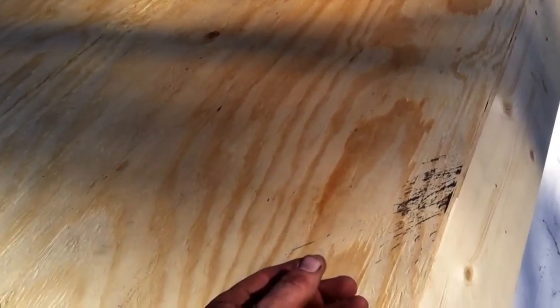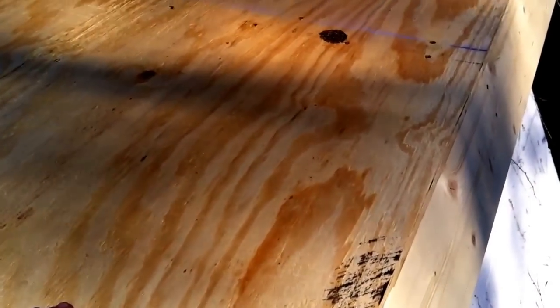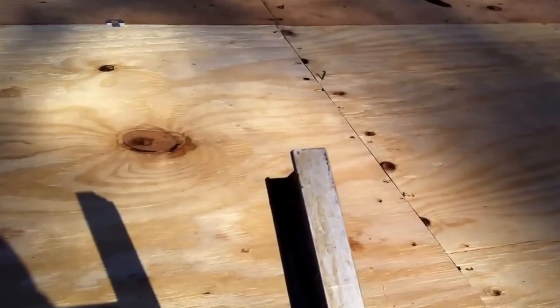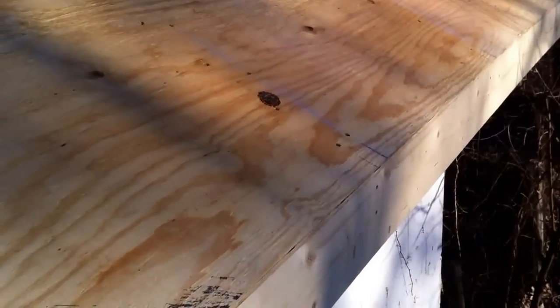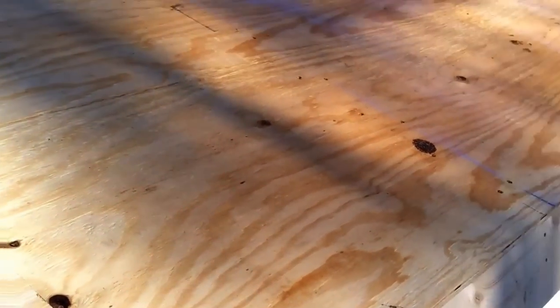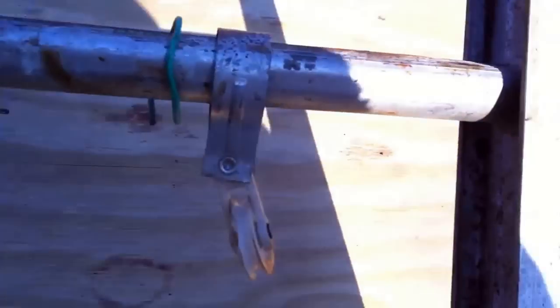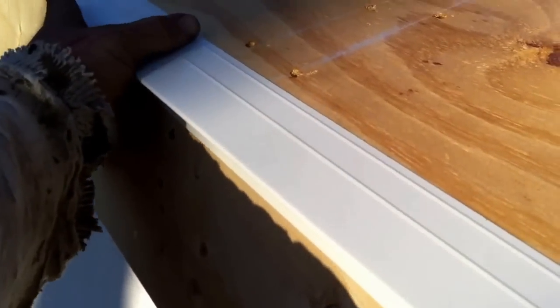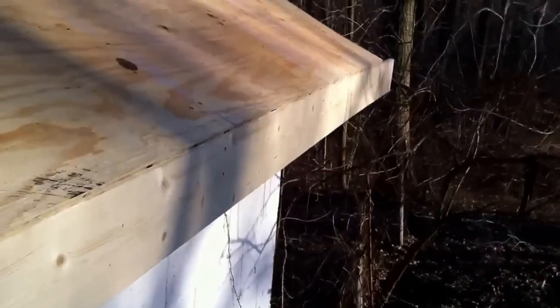Especially when you have snow loads, it's supported by the fascia. This is the fascia, but there really should always be a sub-fascia — I get into debate with that with a lot of people. But this will bear the weight of a snow load here in Maryland at the 38th parallel. In Colorado it's a 2x6. So long story short, that's the reason why it's so important to have rafter tails you can nail into and fascia that's solid, because it also supports the sheathing. God knows there are many roof types. With something solid and straight, your drip edge will fit really nice and secure. Then we'll go ahead and weather-watch this lower course, re-paper it, and start shingling. Don't forget to rate, subscribe, and comment.